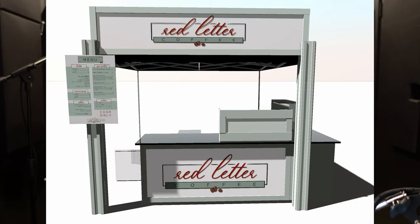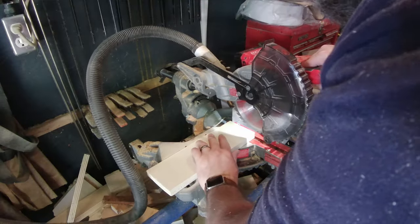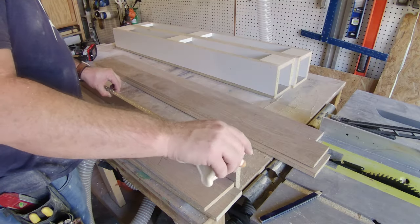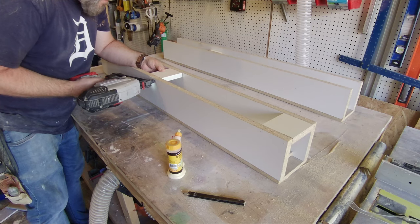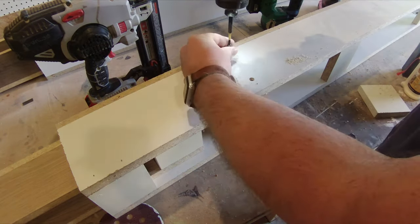To start upgrading, the first thing I wanted to build was a sign that would go up and over the cart and be in front of our canopy, so when you walk by it doesn't look like just a couple of carts with a tent on it. I wanted it to be something you could disassemble, reassemble, and fit in a car. I basically built a three-sided box, used glue and brad nails to hold it together, and for the more supported pieces where the legs would need to support weight, I countersunk some screws that I would fill later.